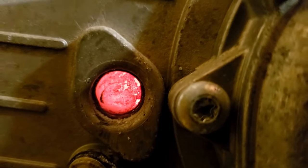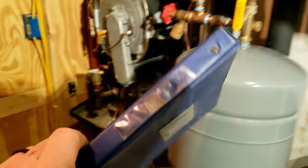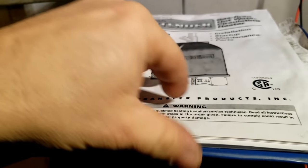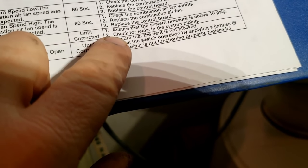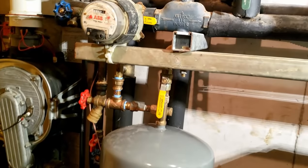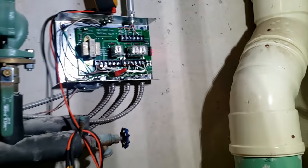This thing is now working — you can see it's glowing red. I haven't cleaned the flame sensor yet but it's been running good. That PR code — I found the book hiding here, unlabeled but sitting there. I looked up that code: PRO means pressure switch open. It won't clear until you make sure it's good to go — the pressure switch has to be at 10 pounds. So we got that. The original setup had this set at 15, which it didn't need.